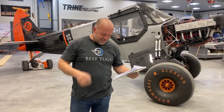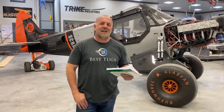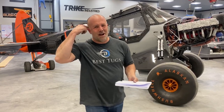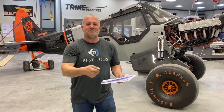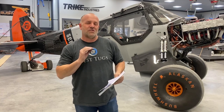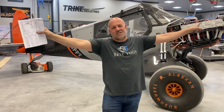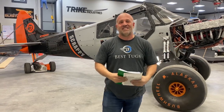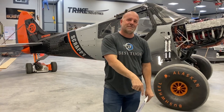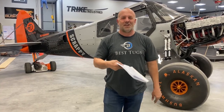Woo! What's fun to think about is how much weight you can hang on the tip of Scrappy, literally at the tip. So if you were worried about whether or not you'd hang your hammock up, don't, even if it's at the tip, not at the wing strut. Because at the tip of Scrappy, with a full return to zero, no damage to the spar at all, I can hang a Carbon Cub, motor and all three wheels off the ground, off each wingtip of Scrappy, and not hurt the wing spars. That doesn't count the additional support of the rear spar that's also a couple hundred percent stronger. So I don't see any reason I'd try and hang a Cub from my wingtip, but I could.